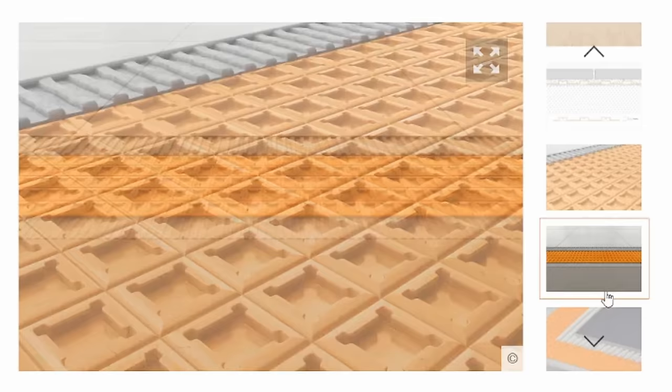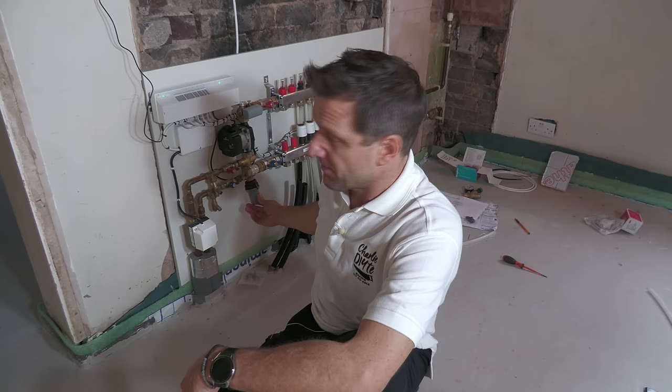The surface is admittedly quite pitted despite the dappling, with air bubbles that rose to the surface — but that really doesn't bother me as I'll be installing a decoupling membrane with large porcelain tiles on top. The most important thing is there isn't a single crack across the entire surface of the floor. In the next video I'll report back on the actual delta T and what temperature I've settled on, though I won't be able to finalise that until all the insulation is in. My suspicion is we'll eventually be setting the manifold temperature to quite a lot less than the 35 degrees Jim designed.